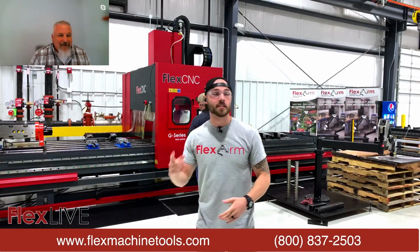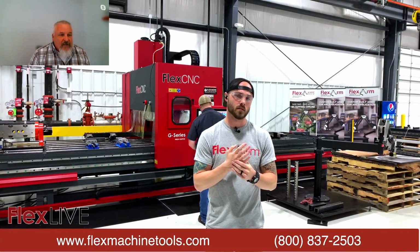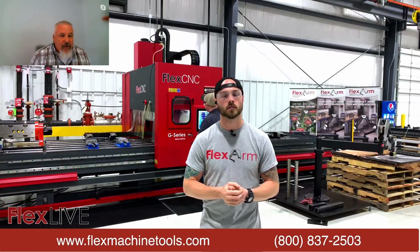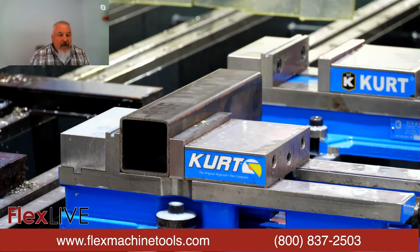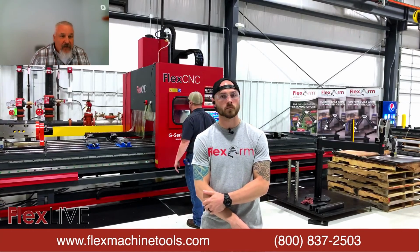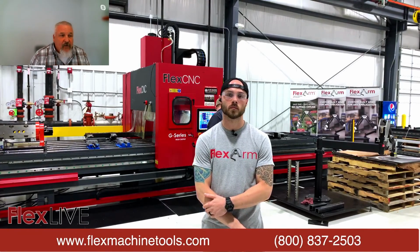Might want to turn myself on there. So as he's getting this finalized, is there anything that we're going to see that's different when he goes into this steel tubing? It's the same process. The thing that's going to vary is the cycle time will be a little bit longer. We're pushing a lot more material down in there. So you're going to see that difference in cycle time. But as far as the process goes, it's irrelevant what size it is. It all follows the same operation as you see it going through the material. It heats the material, it softens the material, it allows that bit to advance on through. We're typically going to be achieving about 3 to 4 times the original wall thickness. It'll be a little greater in this situation because we've got a larger diameter. We're folding more material down into that bushing, if you will, formation.